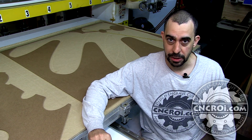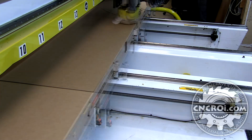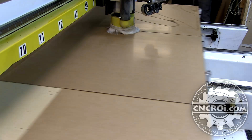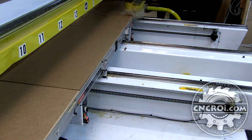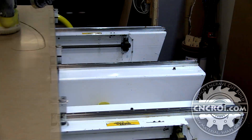In this case we use quarter inch material. So whether we're making a very large stencil as you see here, or a very small one using polycarbonate material, it doesn't really matter. What you have to always keep in mind is that at the end of the day, this is a stencil — there are inside parts and they're going to fall out. That's why you definitely need support material.